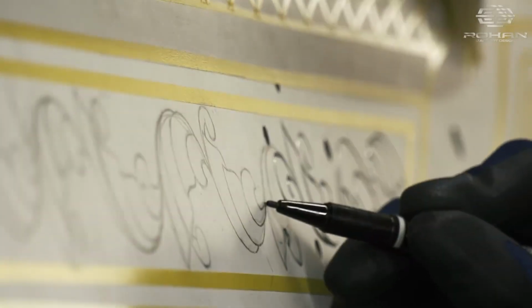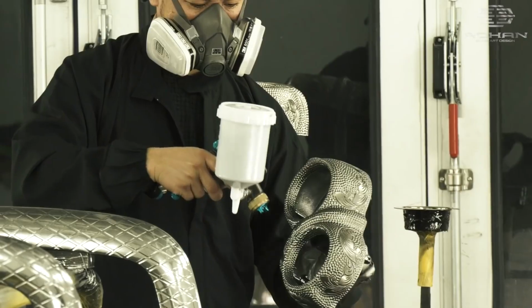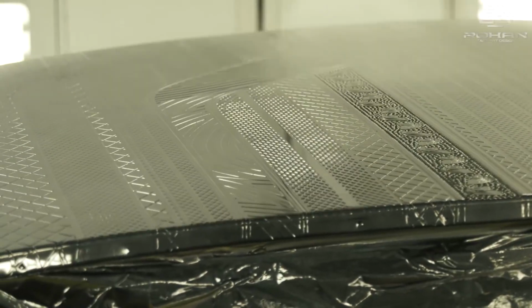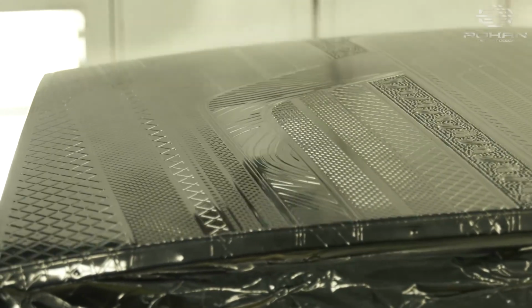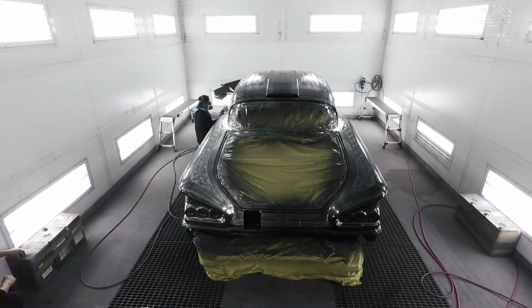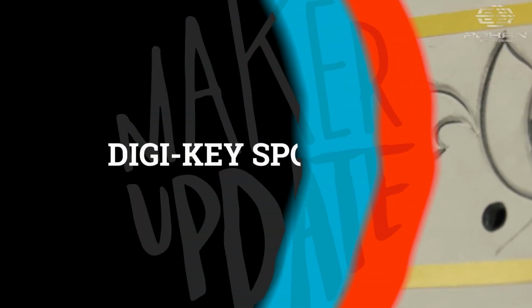on plastic paneling. So what they actually do is build up a super thick base coat of paint, engrave into that, and then coat it all with a special metallic paint that they can polish to a shine. It blew my mind, and the results look awesome. It made me wonder if a similar effect could be achieved with 3D printed engraving and a chroming process, or some other way to apply this technique to projects or enclosures. I'd be curious to hear your thoughts in the comments.